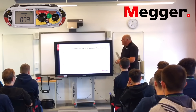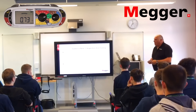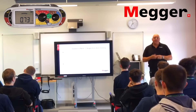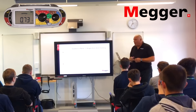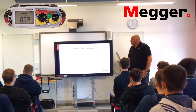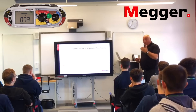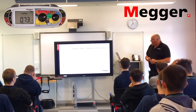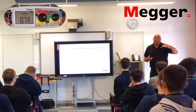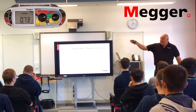For inspection testing, three types of measurement are typically available, listed in order of preference: two-wire high current test, three-wire non-trip test, and two-wire non-trip test. Your two-wire high current test is going to trip out the RCD if there's one in the circuit — so typically it's only done on a circuit without RCD or RCBO protection. If you've got RCDs and RCBOs, do your three-wire low current test. Your two-wire non-trip is ideal for testing at light switches, so you don't need to get up to the light fitting.